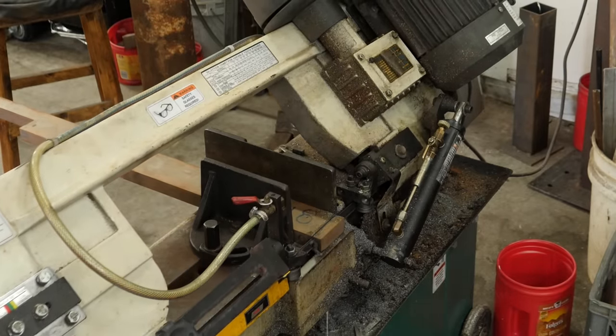I'm done shaping the carbon fiber handle — I love how it came out. I was a little unsure because this handle is a shape I've never quite done before. It's got this really nice flat area with a little rest for your finger and then a raised area. The relation between the guard and the handle is looking good. We have one more thing that needs to be shaped and that's our pommel, which right now is just a big rectangle. I'm going to be doing what's called a museum fit where the handle material is larger and there's a little rounded corner where it meets up with the pommel and guard — I like to call that little rounded corner the bullnose.